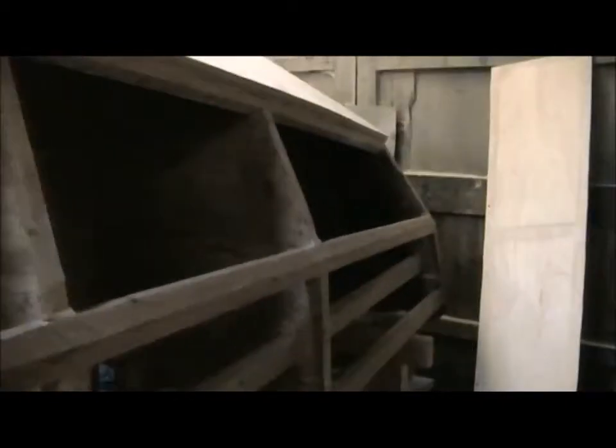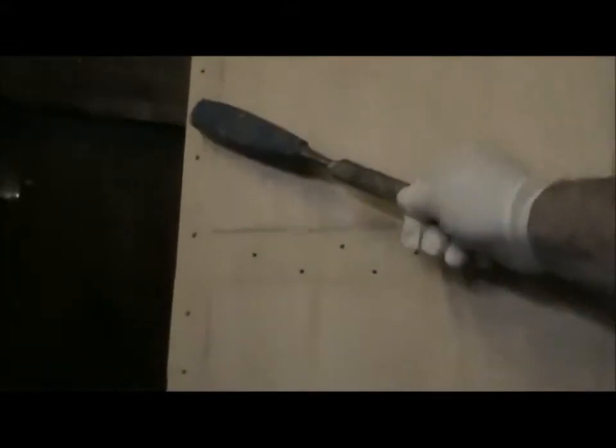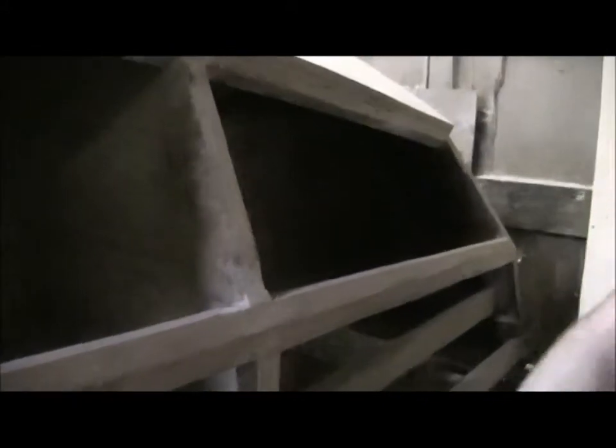This is the area that we are going to put the panel on. On the panel itself, we've marked out the areas that we are going to take the glue. We've also put two dowel holes in. The dowel holes are purely here to help us lift up the panel, slot it in place, and then give us time to hold everything down while we push and glue everything into position.